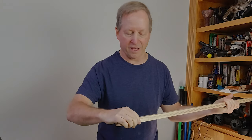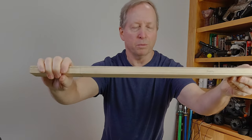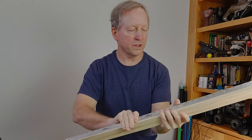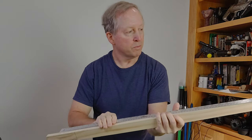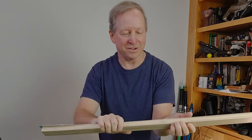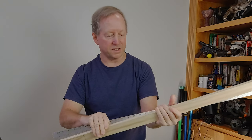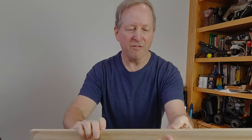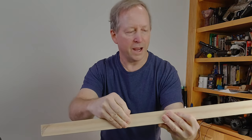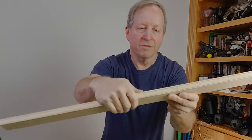The handle is square and I didn't like that, so I've marked where I'm going to shave back the corners. I've labeled the back and front. I took a metal ruler, used a couple clamps, put it down on the table, and made marks slightly in on the one-inch side — that's the way it goes with American lumber. I've made similar lines on the front: one at the center of the face, and one on either side about a quarter inch. That's what I'm going to taper it down to from the back, so it's going to slope.